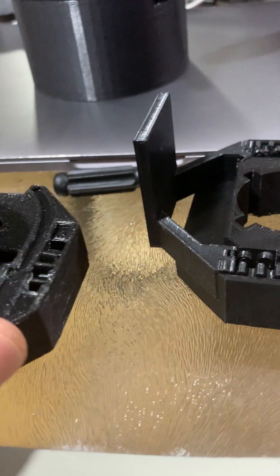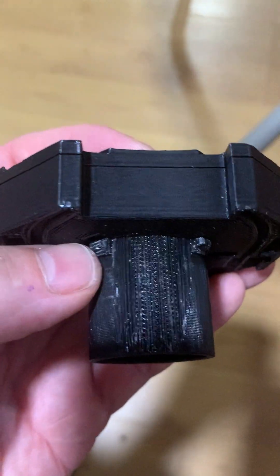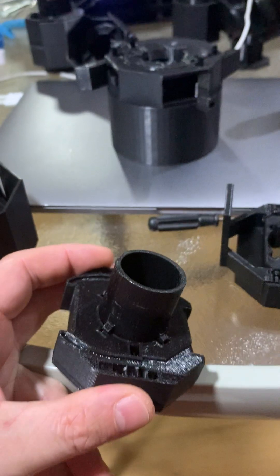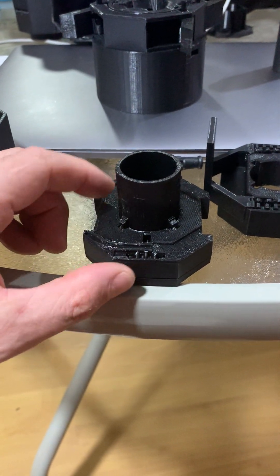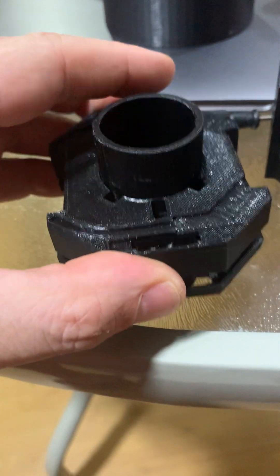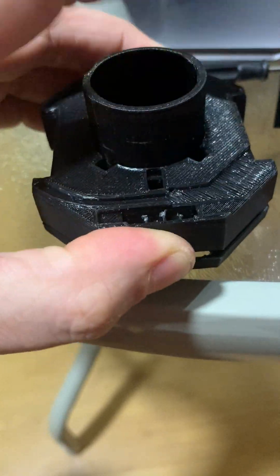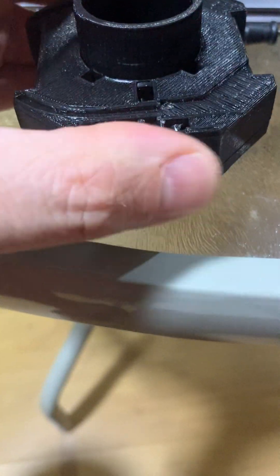One of the things that's very important for assembly is the start position of this piece. When I assemble it I've got to put the buttons in with the first tooth sticking out just a little bit. As this thing travels up and down the gears are only on one side, and I've added mock gears so it slides up as per the previous explanation. The overall travel of the gear sandwich through here is a lot smoother now; the gears are still a little sticky but it's good enough.